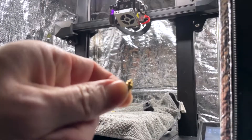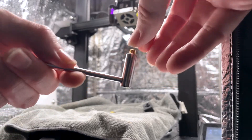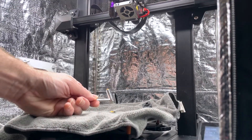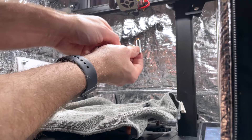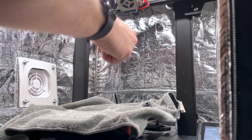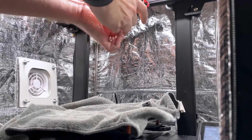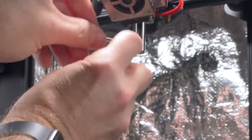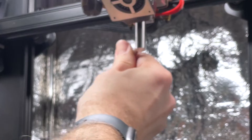Here's the new nozzle. I'm going to drop it point-down into this little tool. It may take a little finagling to get in the right spot, especially if you can't see real well — it is awkward. So I raise up my Z-axis a little bit more, then use that tool to screw this nozzle right into the bottom of the extruder. It takes a little finagling, but I eventually got it turned in the right direction. I also have trouble when doing things upside down remembering righty-tighty lefty-loosey.